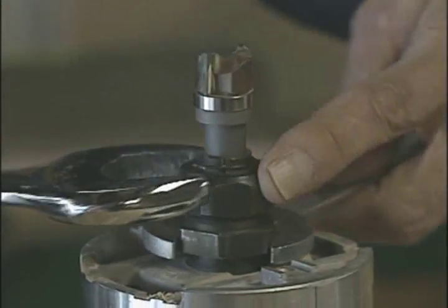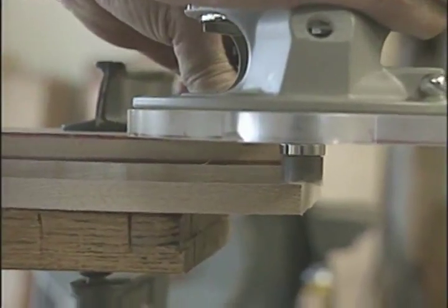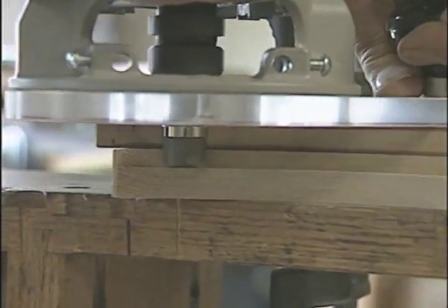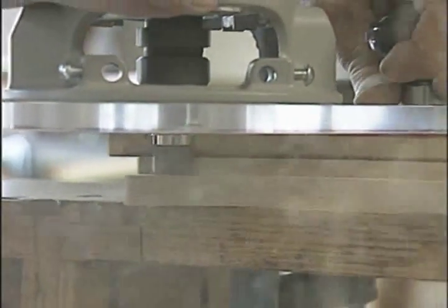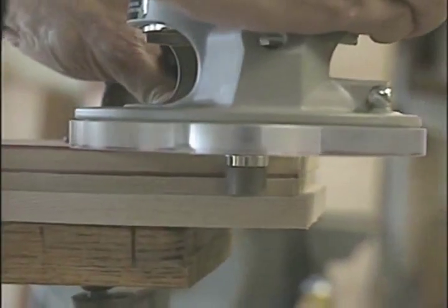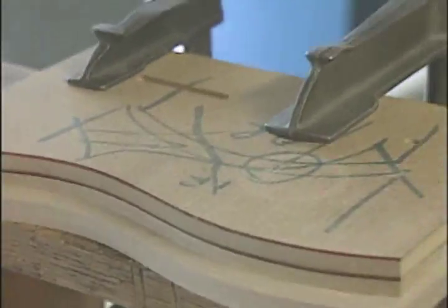The next cut is a fractional thickness cut. Raise the cutter and waste as before. Hang onto the work and template with at least 2 clamps. If the template slips, you'll ruin the work. Keep the clamps at least 1 router base radius away from the edge of the template. A shank bearing guided tool requires the template on top of the work.